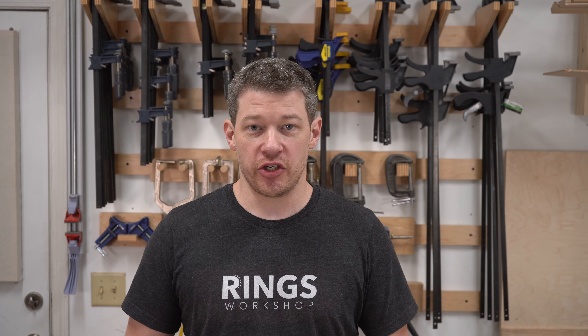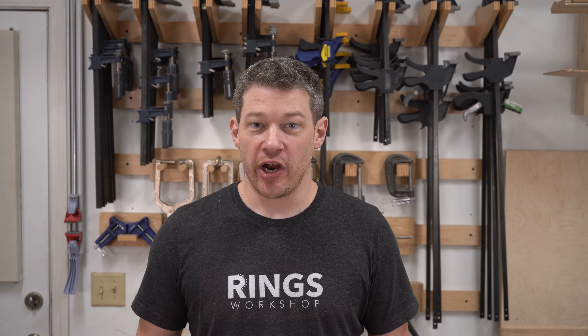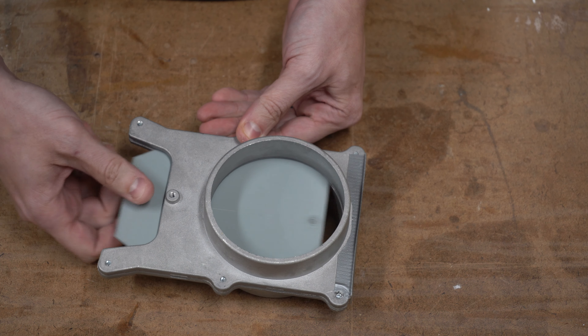So far we've allowed the gate to fully open and eliminated the air leaks on the inside. Now we need to figure out how to get the air to stop leaking on the outside when the gates are open, as well as allowing sawdust to escape and not clog up inside the gate. We already greatly reduced the air that can escape on the outside by cutting it in half, but we still want to take care of that last little bit. To do this, we're going to take a page out of another YouTuber's book. Learn2DIY posted a video earlier this year that addressed this exact issue with a pretty ingenious solution. It doesn't look the greatest, but it actually works really well, so I'll link that video in the description below, and we're going to tweak it a little to make it work even better.